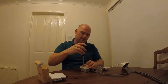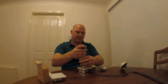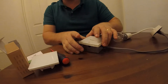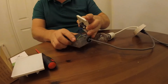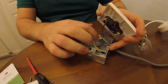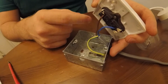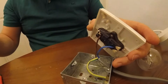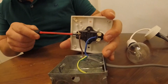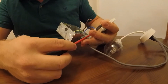Start by taking the switch apart and removing your old original switch. Now we've got the old switch out, we can take it off. There's a wire — as you'd expect to see, that box earth wire in it — and two live wires: the switch live. Get the other screwdriver and take your original switch off. Don't worry about the earth wire; we don't need to touch that.